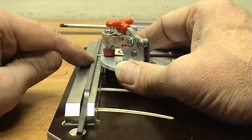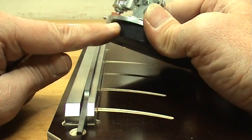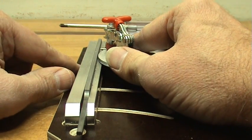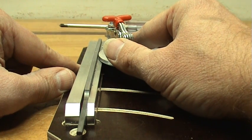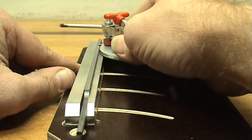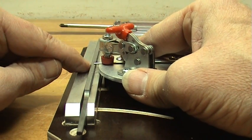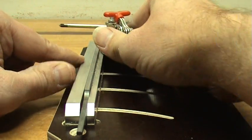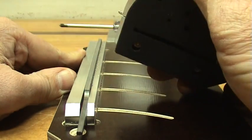I'm going to start by positioning the slider by pressing the fret wire against the file and then rotating the slider until the rounded portion makes contact with the file block. This is the starting position. I'm going to use a pull stroke to file the tang while maintaining slider contact with the file body. As I'm doing this, I'm rotating the slider body until the fret wire is perpendicular with the file. When it is, the fret tang has been removed. Usually about 4 or 5 strokes, and the tang is ready to go.